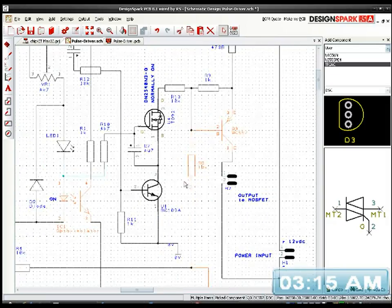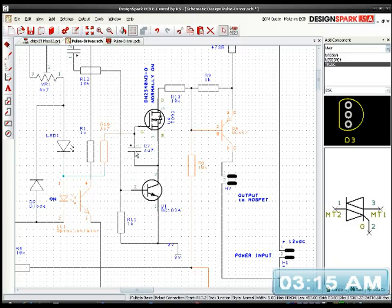Right, so going back over here, because the LED down here, as I was explaining, can only conduct about 3 volts, whatever the voltage is across this, through this resistor and across here, on this capacitor, it will never really get very high. It will be just sufficient to keep that MOSFET turned off, and because it's off, the BC109 down here can't do a damn thing, because it's no longer got a voltage on its collector. So this collector has got no voltage because that's off.